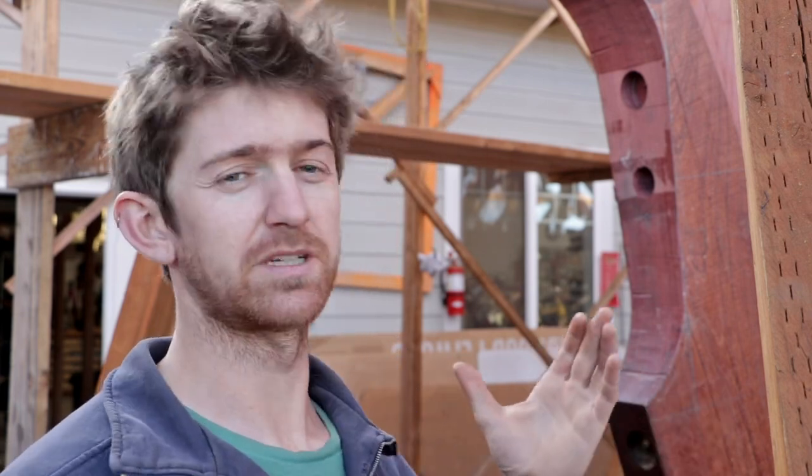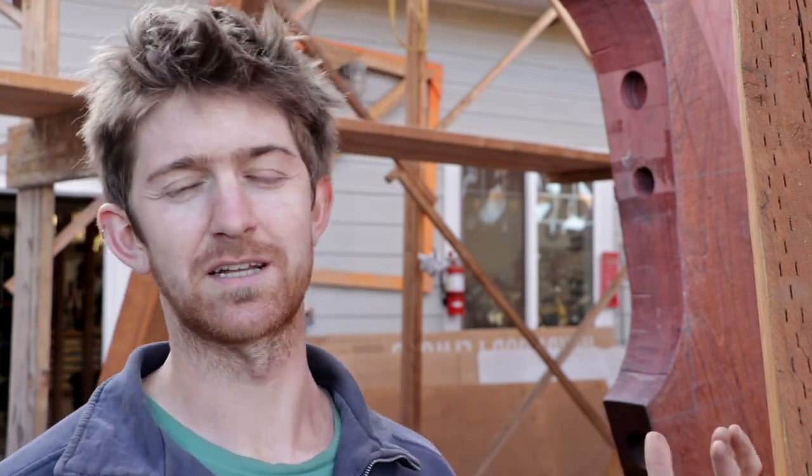Now, this isn't quite the final diameter. It is going to be a little bit larger, but I don't want to drill that out until I've got the stern tube in my hand and I can measure it exactly. But now that the hole is big enough to get that large boring bar in it very easily, and I know how effective and easy it is to set up and use, I consider this job largely taken care of, and finishing that up when the time comes is not going to take much time at all.